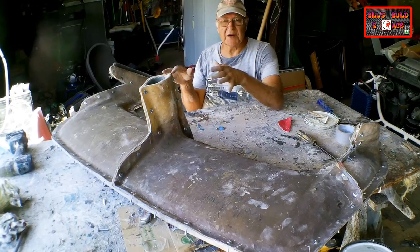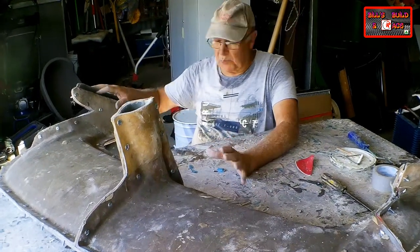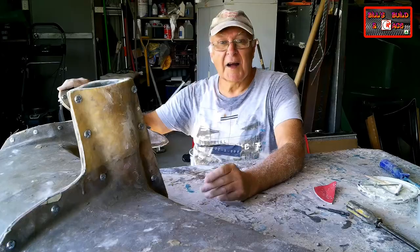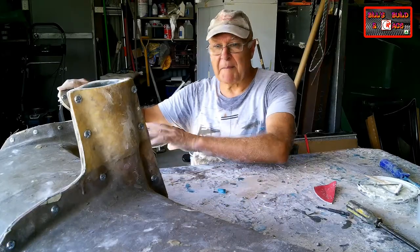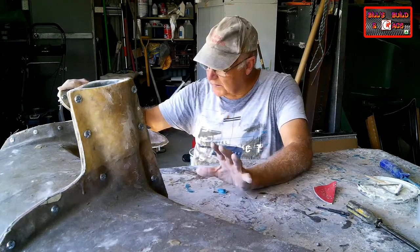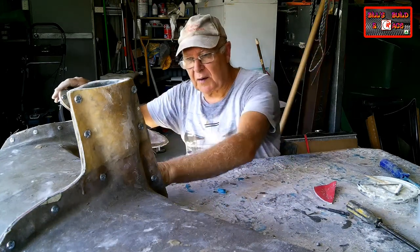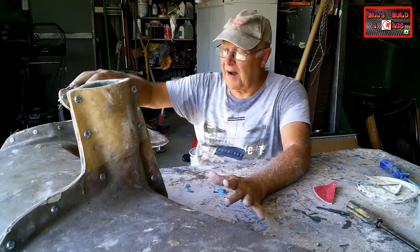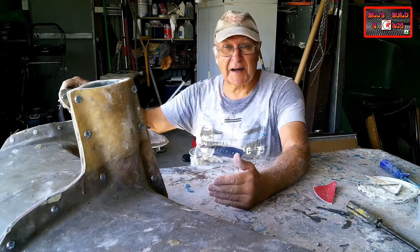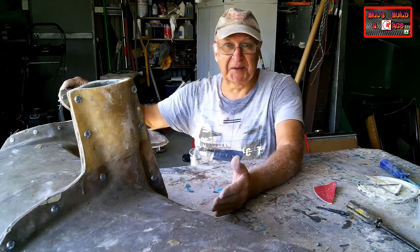All five pieces of the wing are trimmed, put back in their molds and all bolted together. I'm ready to glue them together and make this one piece to go on the car. And a word of advice to anyone who might be making a multi-panel car part like this commercially. It takes twice as long to get all these pieces trimmed, the molds separated and then bolted back together. It takes twice as long to do that as it does to make the actual parts. So when you're doing your costing for your time and your labour, allow for that. This job is definitely not just about materials.